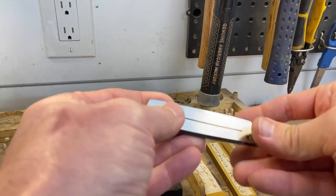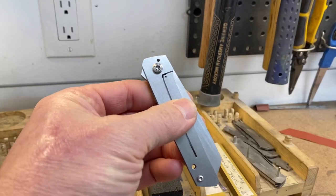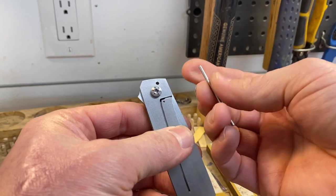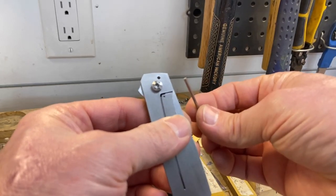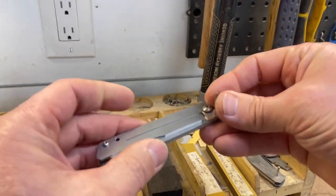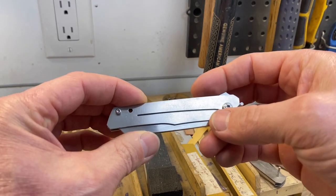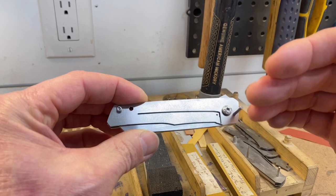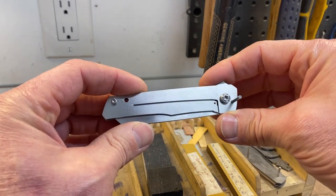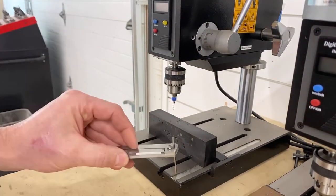So it's kind of loosely fit up in the closed position. Now I'm going to take this pin — this size is a little bit undersized from what your regular stop pin will be. I'll put that in there, and what it's going to allow it to do is allow this blade to close a little bit farther than it wants to. That's going to put this hole, once I put the normal stop pin in, a little bit farther forward. So next we'll drill this thing in — got to hold the blade in tight.